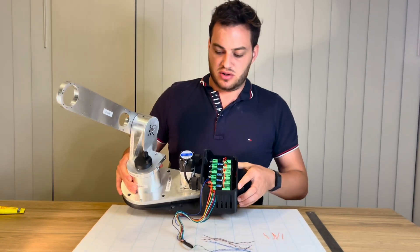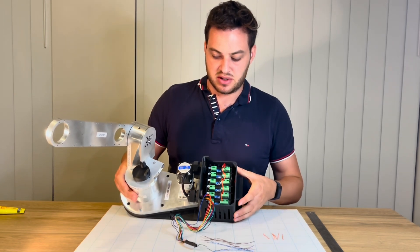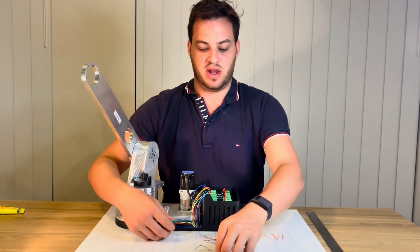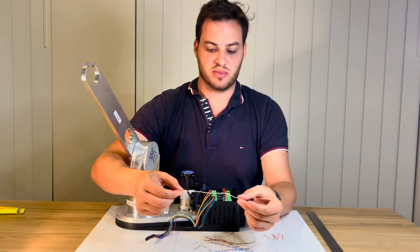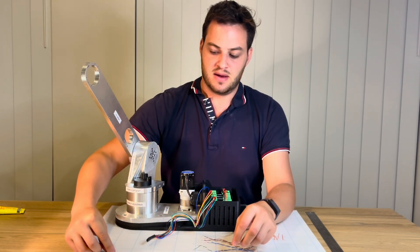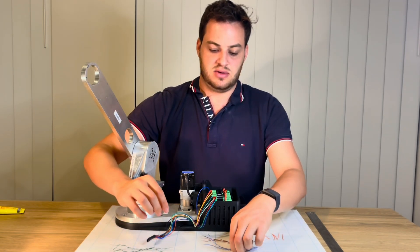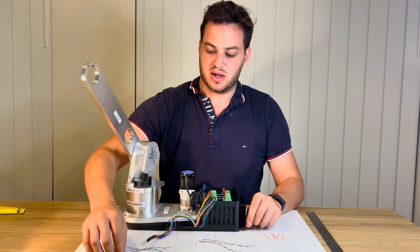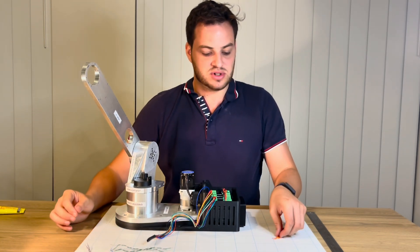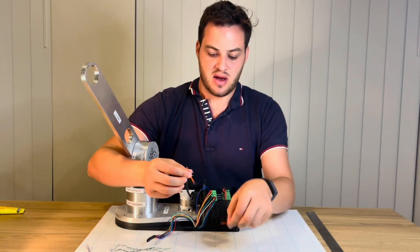We bring the J1 base enclosure and the full robotic arm assembly back onto our workbench. We have all of the joint one wires: the longer striped orange cable set aside, two green and striped green pairs, two blue and striped blue pairs, two brown and striped brown pairs, and five pairs of 50 millimeter long jumpers for the opto terminal.